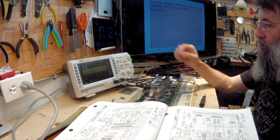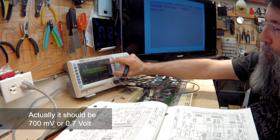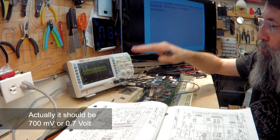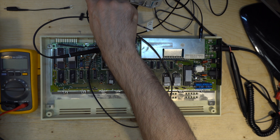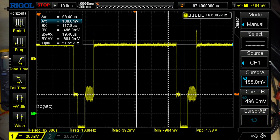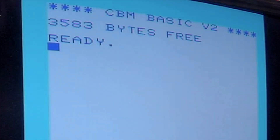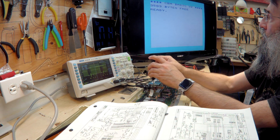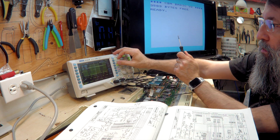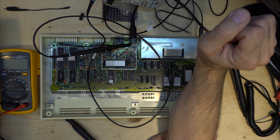This is what it looked like when I got it — the video level is too low. It should be about 700 millivolts from black to white. So let's bring this up a bit. There is a difference of 664 millivolts, which is okay, though I could go a little higher — it's bleeding out on the letters. So let's bring it down a bit, until about 660 millivolts, which is correct. That takes care of the video output.